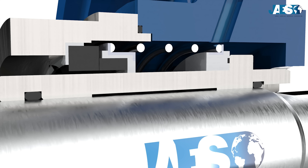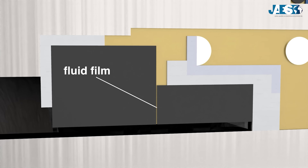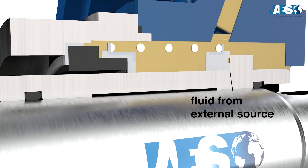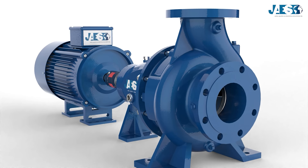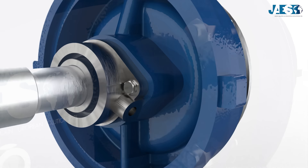For this reason, the faces of the two parts that are in contact are made of flat surfaces worked with extreme precision and smoothness. Besides, the pressure inside the pump, combined with the centrifugal effect obtained from the rotating part's rotation, causes a fluid film to be created between the faces in contact, made from the same fluid pumped by the system, which lubricates them and also prevents direct contact. This lubrication film can also be introduced from an external source. In this way, the mechanical seals can isolate the internal pump room from the external environment, despite the presence of the rotating shaft.